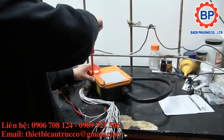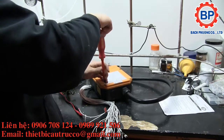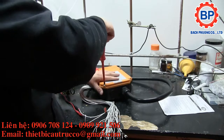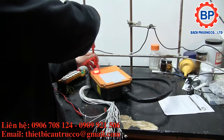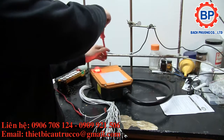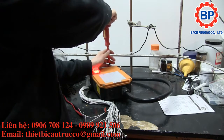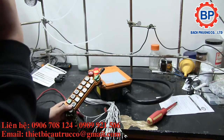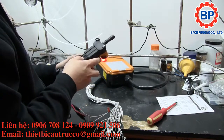Oh, and I guess another thing too is these screws are a self-threading screw meant for plastic. They're not made with threaded inserts. They're not machine screws going into press fit inserts in the plastic. So if you go in and out of this box too many times, you will wear it out. But once you set the voltage tap on the power supply, there's no real reason to go back in and out. So I can see why they cut a couple cents out of that. It's not nice to see, but you know, at the end of the day, people have to run a business too. So yeah, on the remote side, pushing this aside, gonna need a different screwdriver.